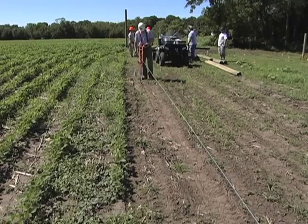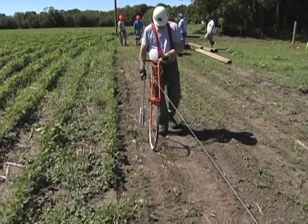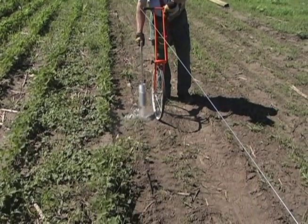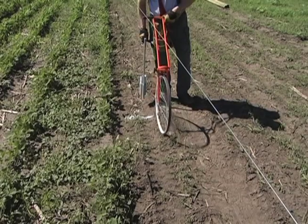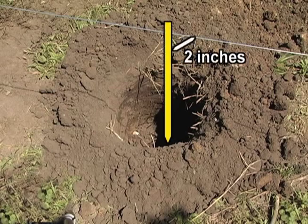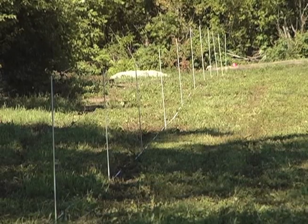Now it's time to take your 300-foot measuring tape or measuring wheel and mark the center spots for the line posts, which will be 20 feet on center from the brace post on the gate or corner assembly. The center marks for the line posts should be 2 inches inside the guide wire. This will give you room to adjust the posts to stay inside the guide wire. Use paint marks and stakes or flags for marking.